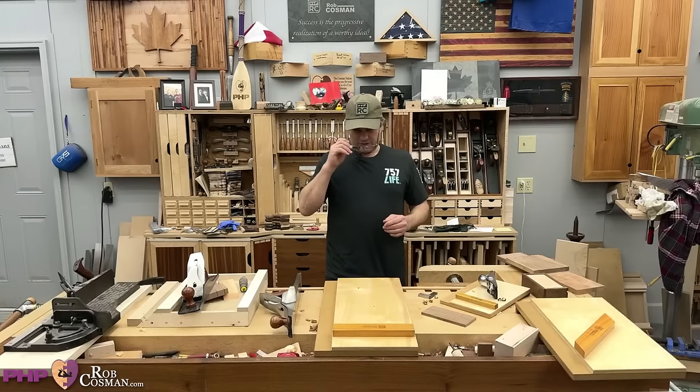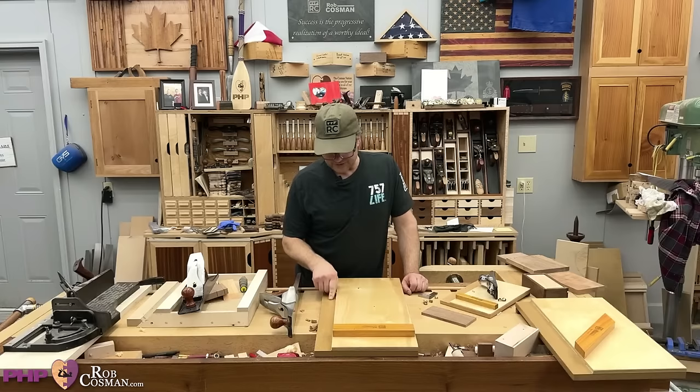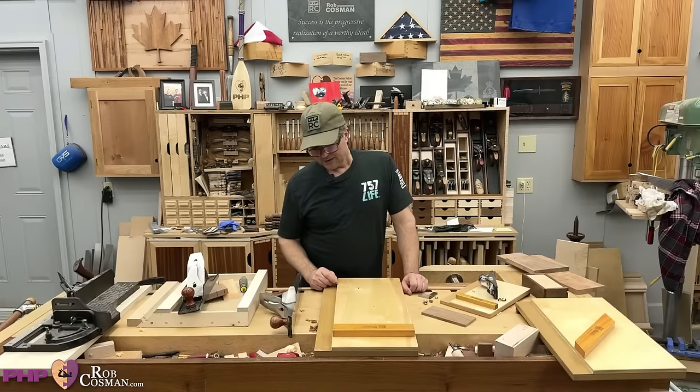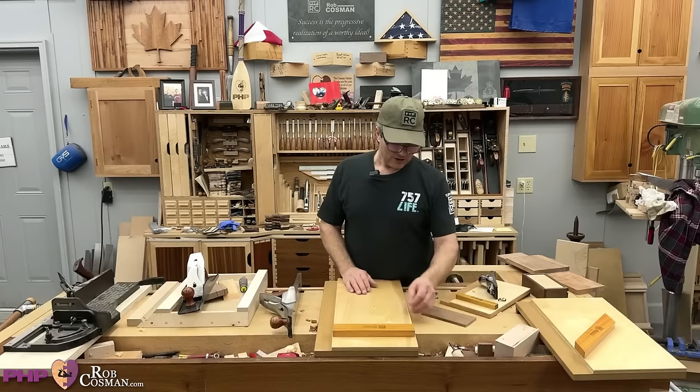First thing that you're going to do is choose the right materials. So what we've done is we chose a piece of MDF. Why? As Jake mentioned earlier, it's stable. It also has a hard-wearing surface. So although it's not going to last forever, it'll last for a long time. It's nice and hard. The second piece of material is a piece of Baltic birch. When it comes to using plywood, the nice thing about Baltic birch is all of the components, all of the layers, if you will, are made out of the same material, birch.